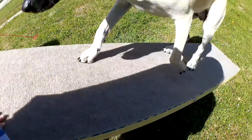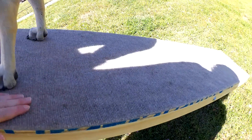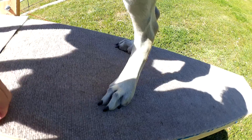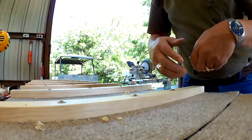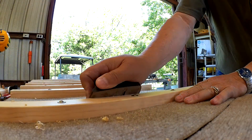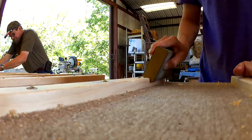We had hoped the carpet would be easy on the pups' feet, preventing splinters and giving them traction. The carpet turned out to be kind of slippery when Vivo walked on it. Small boards placed across the ramp every 9 inches or so work like steps to give the dogs better footing. The sharp edges of the steps are removed with a plane, then sanded smooth, making them more comfortable to walk on.